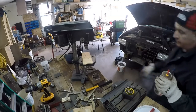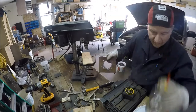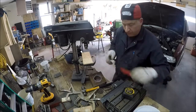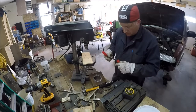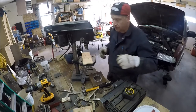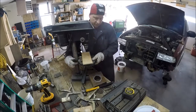Just resetting up — we've got the pilot holes drilled. I'll drill the rest of the holes. I've got a reduced shank 5/8 drill bit but I think I'll do it in stages. The holes are half inch, but we'll see — humans make mistakes. I'm going to drill them down here.